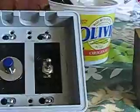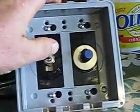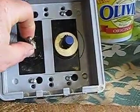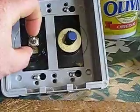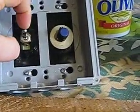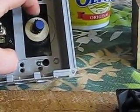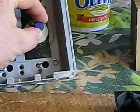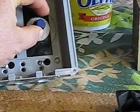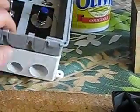This thing here is actually upside down like this so it's an on switch. I got the switch at the restore store for a dollar - it's actually a double-throw three-position switch, so it's kind of overkill but for a dollar. And then this is a rheostat so I can change the speed of the fans. About four dollars at Radio Shack and it'll handle up to three watts. It's 25 ohm so it works well for its purpose.